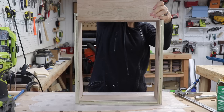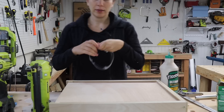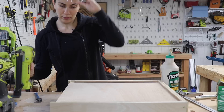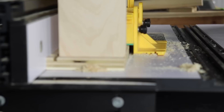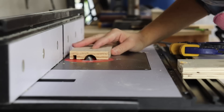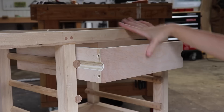After the base was complete I could build the drawers. I made a whole separate video on building these drawers — I'll put a link down below. They're pretty basic and simple, and based on my test cuts earlier I figured out they needed to be built a half inch smaller than the drawer opening. Because I used the eighth-inch spacer on the legs there's also going to be another eighth inch on the drawer, so that's a quarter inch on either side — a half inch total. To make the grooves in the sides of the drawers that run on the dowel, I used a one-inch core box bit on the router table, doing multiple passes until I got to the perfect depth, and after a few passes it fit so well.